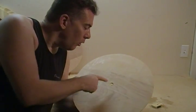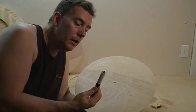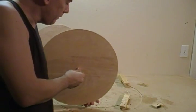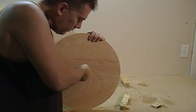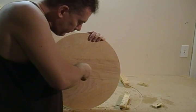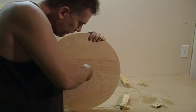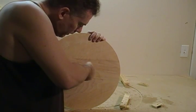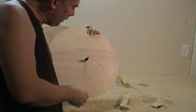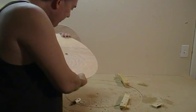On our rotor, we need to open up that 5/8" hole that we scored. I don't have a drill — I'm going to do this by hand. You just put the hole saw on your score mark and eat your way through it by turning it backwards. It's a time-consuming operation, but it's well worth it to keep that hole on center. You can see that was pretty painless.